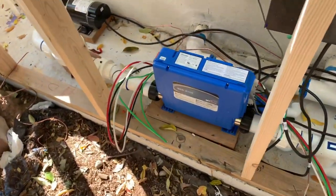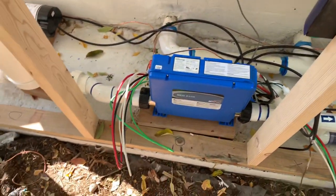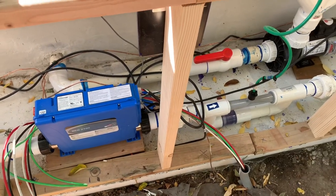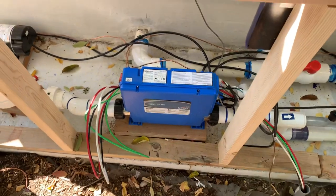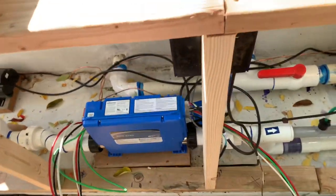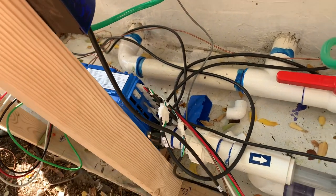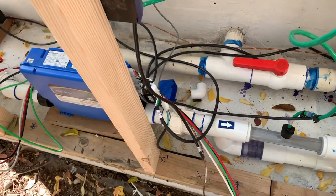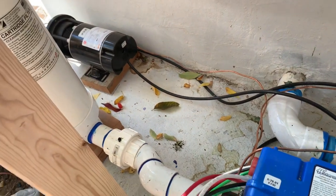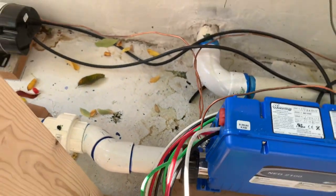The main control unit here — our power comes from right there up, and you can see the wires going around to there. I'm going to change that to have flexible conduit going over to there. I've got it hooked up now just because I was doing a water test and a component test. So that's our main component — the heater element, etc. All the wires stubbing out of there are heading to the various units. Everything in here is bonded with a copper wire — you can see there's a negative terminal block here and I've got a bunch of the grounds going to that.